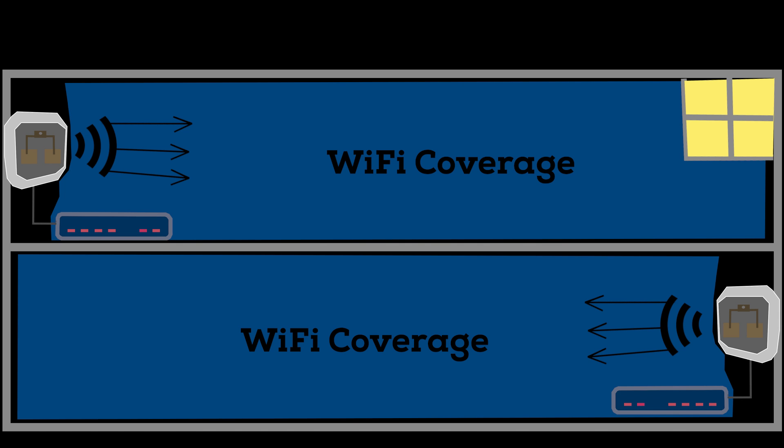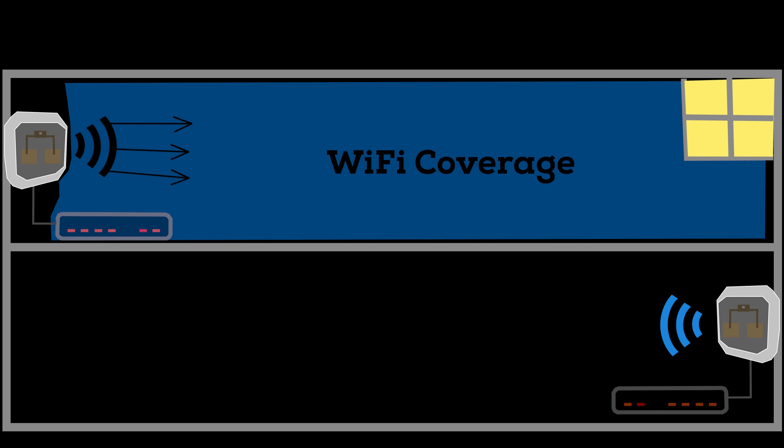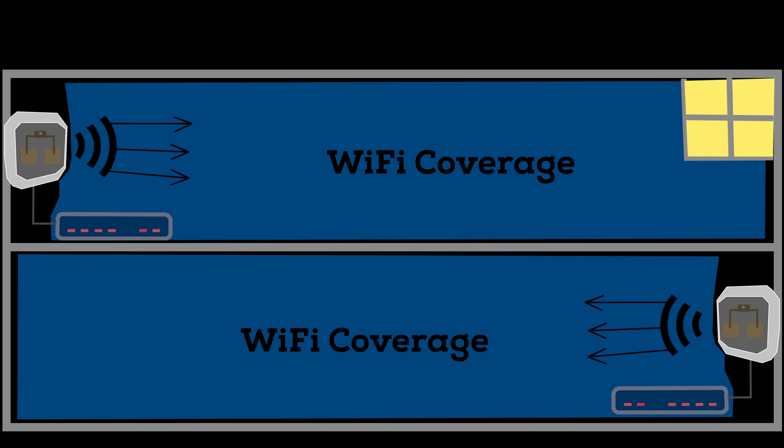An example of semi-directional antennas is a patch antenna. Patch antennas are used in both indoor and outdoor communication setups. They are very good in indoor environments with long corridors, areas of shelves, or dense layouts such as libraries, warehouses, and retail stores. Because of those tall and long shelves, omnidirectional antennas often struggle to provide effective Wi-Fi coverage. By being placed high on the side walls or on the ceiling and aimed through rows of shelves, patch antennas minimize signal leakage outside the intended coverage area, making them ideal for challenging indoor environments.